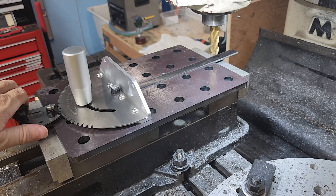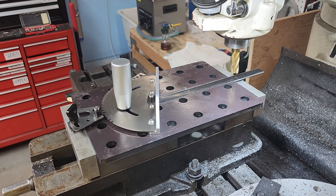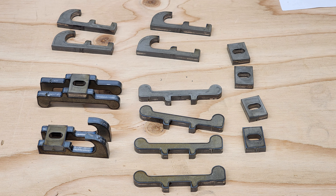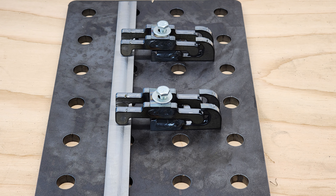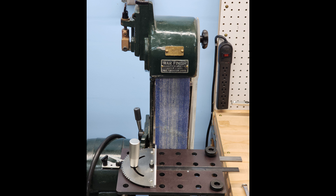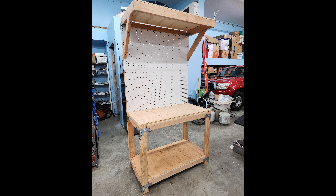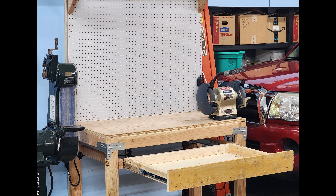I designed a plate that uses the same fixturing as welding tables, with a system to clamp it to the existing table using a bolt-through-cams setup. This was my first foray into an intricate design with laser cut steel. First I milled a slot into the table for the miter to slide in. The clamps were the intricate parts — each made of a pair forming the base and a pair forming the cam, welded together in parallel with small cross blocks with grooves. A bolt screwed through the cross blocks clamps down hard to the lip of the existing table. This worked perfectly on the first attempt and gives me confidence to use intricate laser cut designs for bike parts in the future. I also built another workbench for this area to consolidate belt grinding and sanding, and the new workbench got a drawer as well.